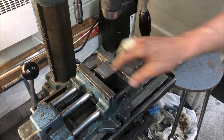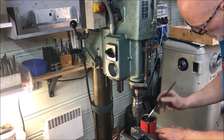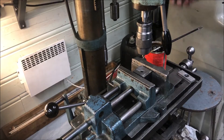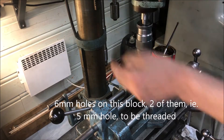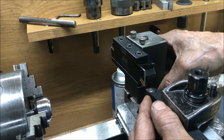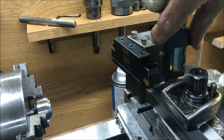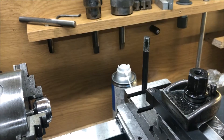I've marked out the center, so I put this down as far as it goes because then my clamping would be more secure. Then the holes here: 6 mil bolt, and then it's a 5 mil hole. Now just measuring how much I should go down with everything assembled — to that point. That should be easy. Seems to be something like 3 mil, so I'll go 3 millimeters down on that side.